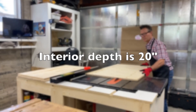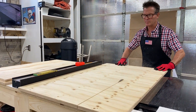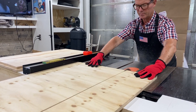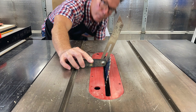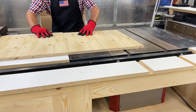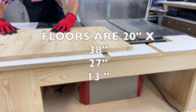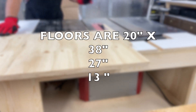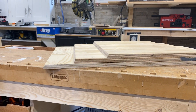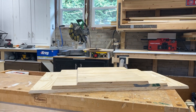Our next step was to cut three-quarter inch plywood to 20 inches, which is how deep the interior of the house is. I set the table saw blade to 22.5 degrees, which is the angle of our roof line for our A-frame. The ground floor is 38 inches wide, the middle section that will have two condo units is 27 inches, and the top floor unit is 13 inches. Kevin cut them to width with that angle on each edge.